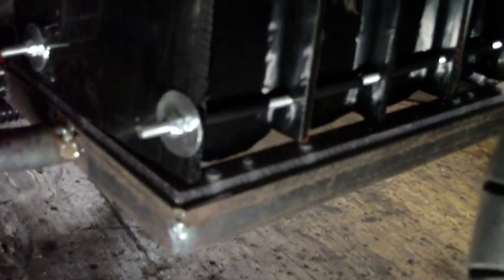It's made up out of a series of four separate blocks. It's kind of a sandwich going on with some HDPE sheet and some 6mm threaded bar to hold everything in place. Down the bottom here we have ourselves some 25mm angle steel forming a tray. And on top of that, to insulate the pack from the chassis, we've got some 6mm clear polycarbonate.